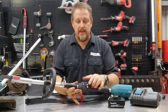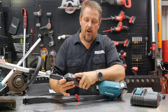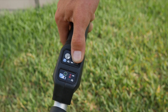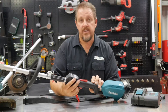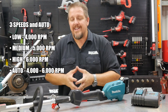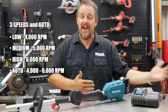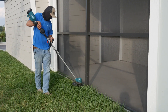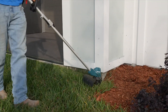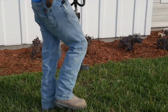Let's talk about a couple of features. First, you have three different speeds you can select right here on the buttons. Once you arm it or turn it on, you'll see the lights light up and you can select between speeds — the turtle speed which is low, then medium, then rabbit speed which is high. That's 4,000, 5,000, and 6,000 RPMs. There's also an automatic mode — a torque-sensing mode — that cruises along at 4,000 RPMs and as you hit heavier grass, it senses that and applies more torque to power through, then draws RPMs back down to draw less amperage and give you longer runtime.